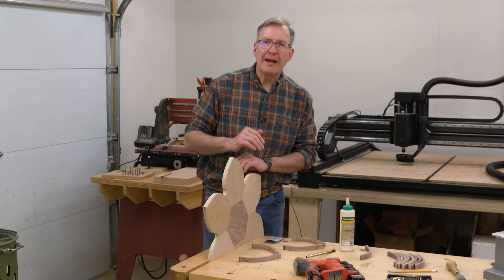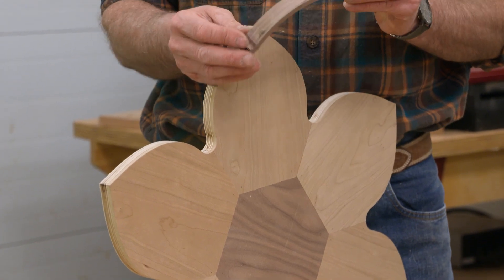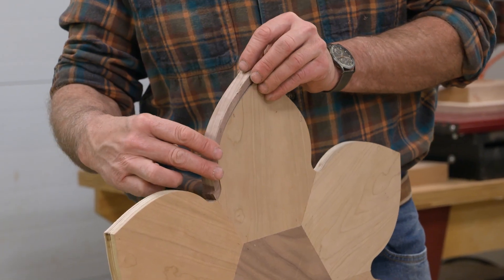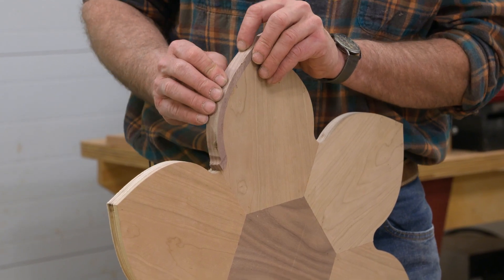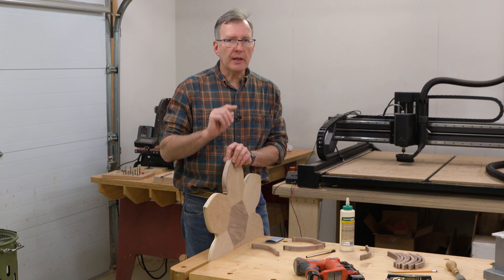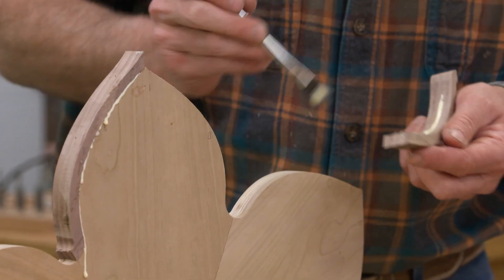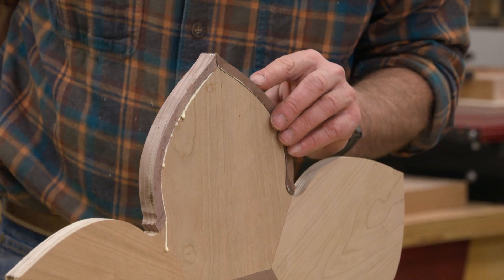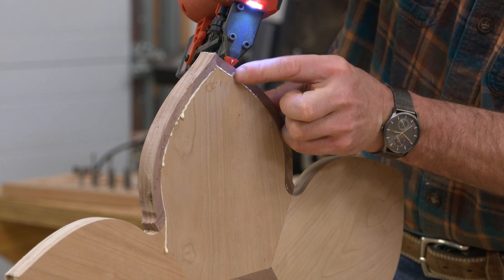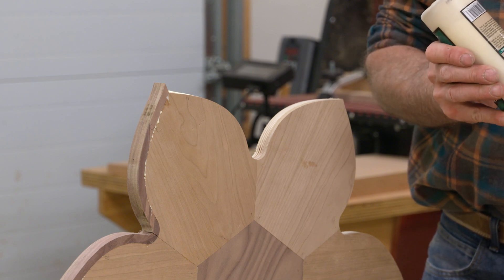As you can see, I've got my flower all cut out — a nice three-quarters-of-an-inch thick, solid, sturdy base ready for the edging. The edging is all separated from its parent stock and I took a little time to sand out the tabs. We're going to go one by one working our way along, gluing each piece on. I'm going to use the pin nailer again to hold them in place. Things ought to fit perfectly, but this is woodworking and we know that's not going to happen, so each one is going to take a little bit of fussing. I brought in a small belt sander — that's a really handy tool for work like this, and so is a good file, a hand plane, or a chisel. I'll finish up all my edging, let it dry, sand off the top, smooth things out, and put about an eighth-inch round-over top and bottom of the edging.